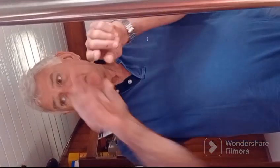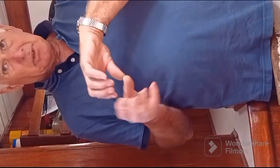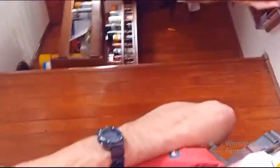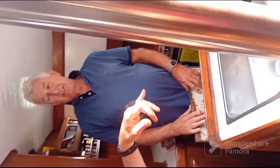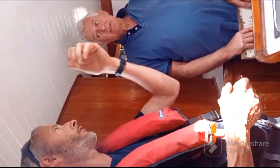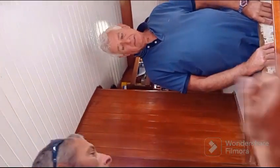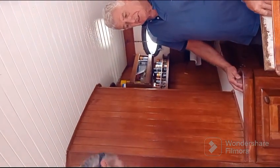So this hose that goes up and down has a little hole in it, so that it actually has an air siphoning effect. It's the same in the bilge pump and everything. The bilge pump also has an anti-siphon. For an engine, the problem is if the siphon isn't broken, you stop the engine, and the engine can then suck water back into itself. That's why you open it: the air can arrive, so the water column goes down and you can never suck water into the engine.